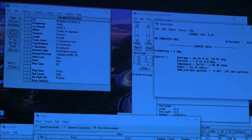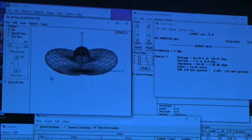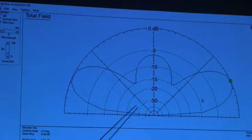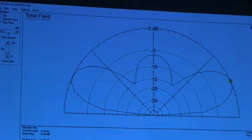54 ohms. Okay, so once again, you've got a thing where it's very closely matched. Look at the pattern. Looks like it's on boresight. You get some strength up, but the majority of your strength is broadside to the antenna. See, now we got 8 dB of gain there, too. And what's happening is,